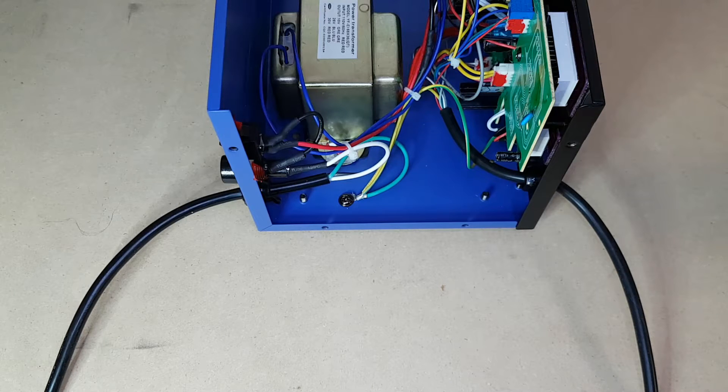This is completely against electrical codes in Canada. It means that if for some reason you have a short to ground from live, the fuse cannot trigger, and the entire unit is going to become live. So this could result potentially in a fire or in an electrical shock. Either of these things is bad.